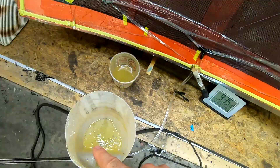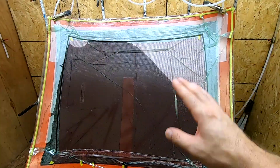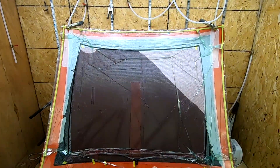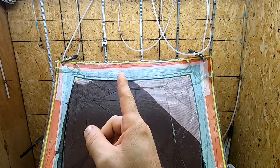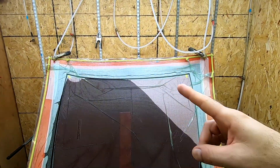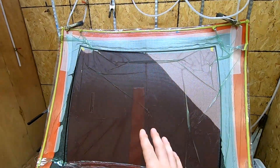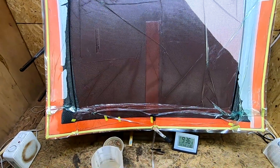It looks like it's going good. Keep an eye on the cup because we are getting close to the end. I've double checked everything — we're all good. I have vacuum lines on both corners so that if the resin makes it up, I'm not relying on one dead center line. If you only had one, it could block and the corner of the part might lose vacuum pressure.